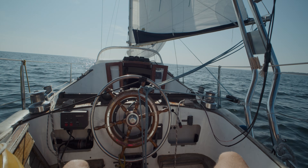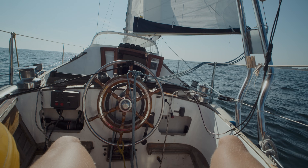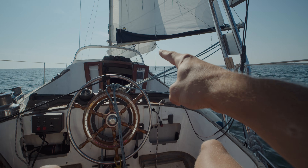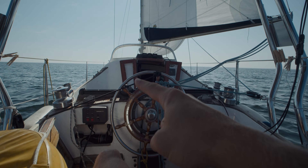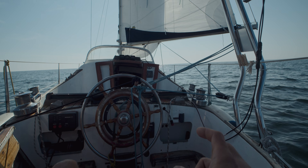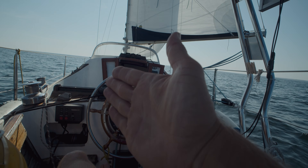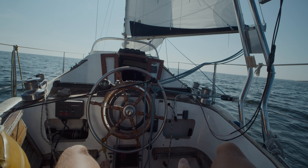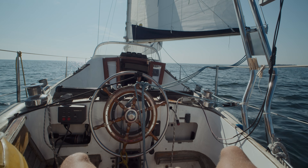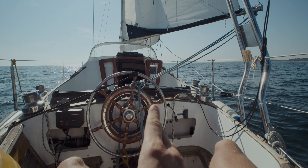You can use a technique called sheet-to-tiller to steer the boat downwind. Here I explain how it works: you have a rope that you adjust through a block to the Genoa, and the Genoa is steering the boat. A rubber band on the other side pulls back the wheel when the boat is supposed to steer itself back again. The rubber band together with the mainsail pushes the boat back up towards the wind. It's not going to go straight downwind and it won't work in every condition, but if you adjust and fiddle a lot with it, it works quite well. You don't go that straight and if the wind shifts it can easily go wrong.